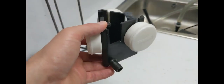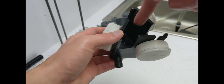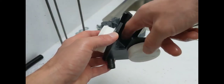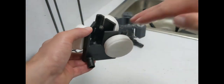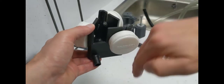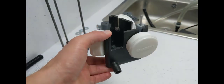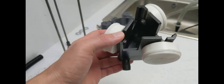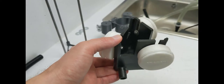Why this one doesn't work: the coolant goes in through three free inlets with the principle of creating a vortex, and that vortex uses a waterfall effect — the coolant goes into the vortex, over the edge, and gets sucked down, so even though it sits on the surface it's still drawn in. The reason it doesn't work is that a triangle isn't very conducive to a good vortex. A vortex is a spiral, so having a triangular shape doesn't really produce a strong one.